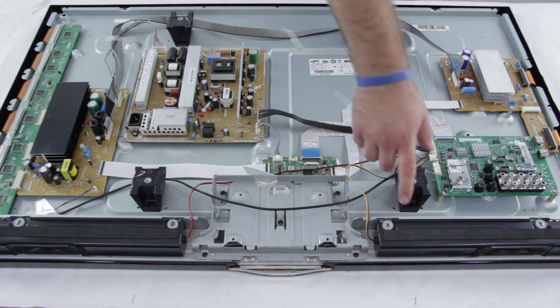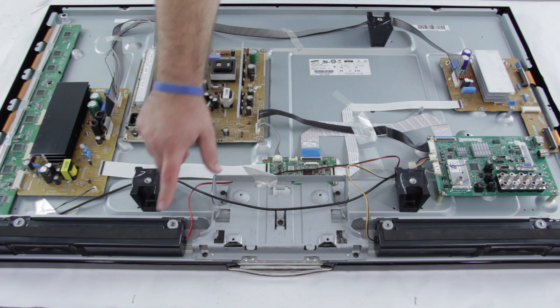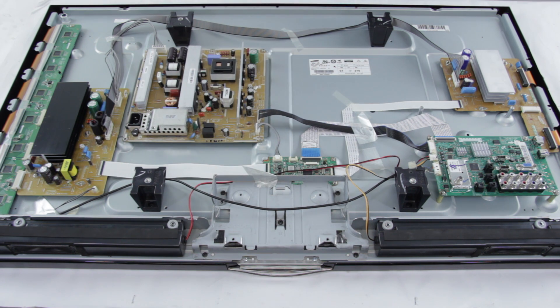Along the bottom of the chassis on the plasma TV are address buffers. In some older and larger plasma TVs you also have address buffers up here on the top of the TV. Some manufacturers will refer to the address buffers as logic buffers as well, and some companies will also give each buffer a different identification letter, typically starting with the letter C. A few symptoms that could be the address buffers is if you have no picture on your screen or if you have a blown fuse on the buffers.